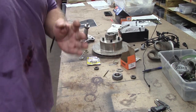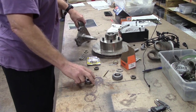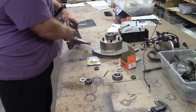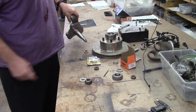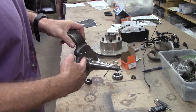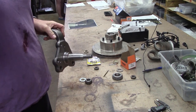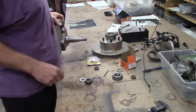We've got manufacturers all over the world. We have a spindle here — this distance to that pin distance. In between there, we've got this distance on the spindle, and there could be variations by 4, 5, or 10 thousandths from here to here. That's just normal manufacturing. We're talking about a spindle, not the machine surfaces on the space shuttle.